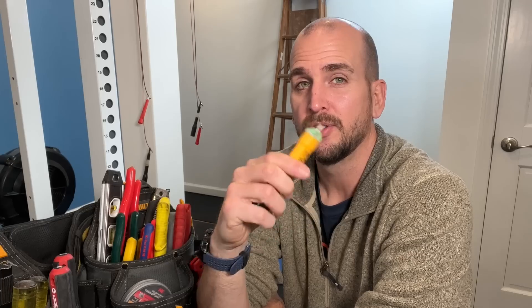So even just brushing the tester on this fleece triggers it in the 12-to-1000-volt range. If I switch to 70-to-1000 volts, it's not nearly as sensitive — I can brush it across my fleece and I don't get nearly as many false positives. For most circuits I'm testing, I use the 70-to-1000 range, but there are certain instances where you might want to detect that lower voltage.